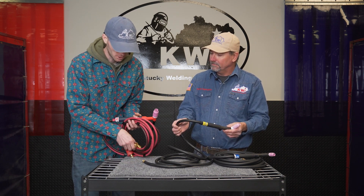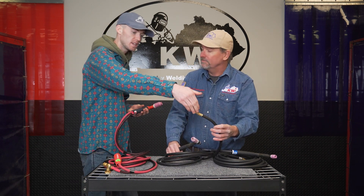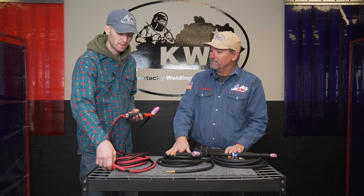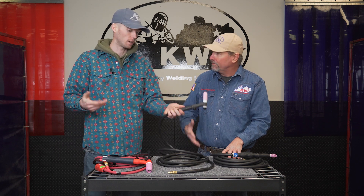Another benefit of the Heavy Hitters two-piece TIG rig is you have a valve so you can shut the gas off — it's not staying in the line if you step on it or pop it. The single-piece rigs won't have a valve, so you could step on it and pop it. You can add a valve to them, but the great thing about the Heavy Hitters is it comes ready to go with a valve, so you can shut it off at either end. The Heavy Hitter rig is a must-have for your box — say you're using the smaller rig all day and the company brings in some heavy wall. About six passes later you won't be able to grab that smaller rig because it'll be so hot. With the Heavy Hitter, it won't get hot at all — you could wear whatever gloves you want.